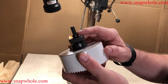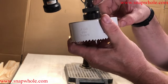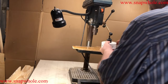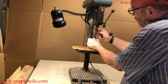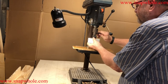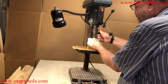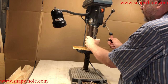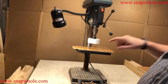If you look at this, the top has a hex shape, but it doesn't go all the way down — at the very end it flares out. If you get that flare in the drill chuck, it will drop out. It'll feel like it's tight, but once you start using it, it'll drop out. So press this up in — don't press it all the way, leave about an eighth of an inch. Tighten it. I watched a video by John Heiss that said tighten all three positions, and then I watched another video that said that was crap. But I kind of trust John Heiss, so I always tighten all three.